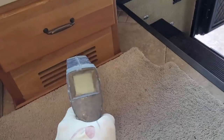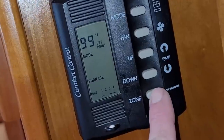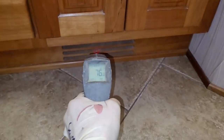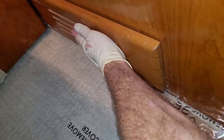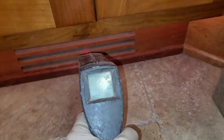I've got my infrared sensor right here. I go down and check it out — yeah, it's hot right there. I'm calling for hydronic heating at the front and in the bedroom. I do have the furnace turned on on all my zones. The bathroom's running at 76 degrees. If I go into the bedroom, it's also running but not blowing hot air. I'll try this last one — all right, that one's running, 77 degrees. So we're agreed it's not heating right here. It was heating at the dash.